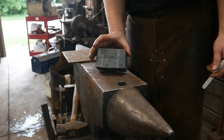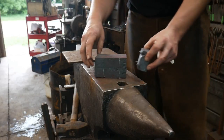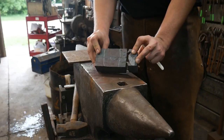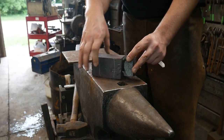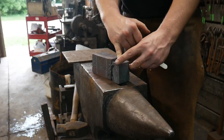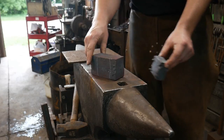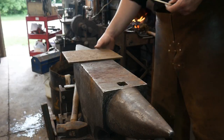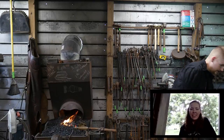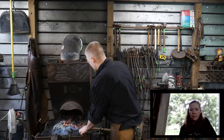So it'll have cheeks on both sides of the hammer. We have to do the cheeks first because if we don't, and we get these hammer faces on there, you could take a chance while welding them up of burning the ends — unnecessarily burning your high carbon steel faces. And we don't want that. So I think we can leave the sketch here. I think this is good and hot — let me check on it.